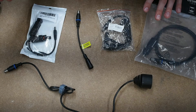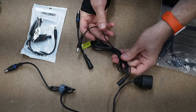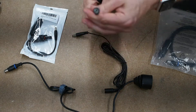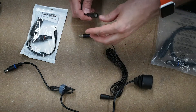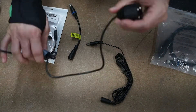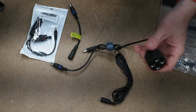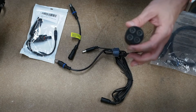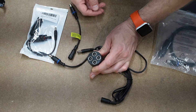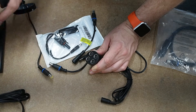My plan is to leave this intact, but I bought a 5.5 millimeter extension cable, which was cheap. I'll cut the male end off and cut the 4.7 millimeter female end off, then splice those two together. I also already have my 4-into-1 adapter from Goal Zero, which allows me to charge my Yeti 400 from multiple sources. Right now I have it charging from the alternator in the van — there's another video on how I wired up a relay for that — and I also have the power brick, which charges from AC shore power. So let's get started.